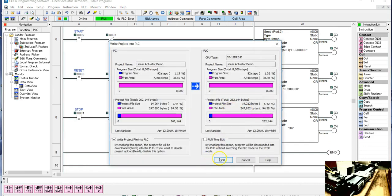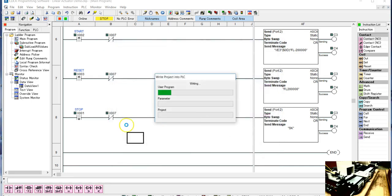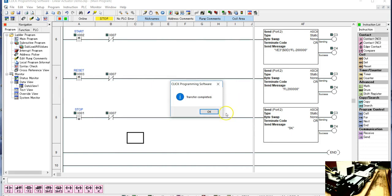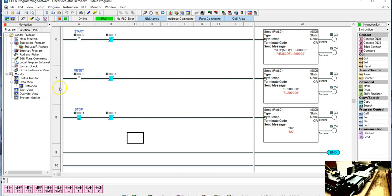These are just a few of the things that we found out by trial and error. The important thing to remember is that the way you load these commands all the time is you have to have these edge triggers. You can only load these commands once. Now, because we just reloaded these commands, I think we might have the default, so it might go full speed when I first hit the reset. Nope, I guess it did. So it's going slow, but now when it's coming back, I'm going to stop it right away.